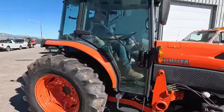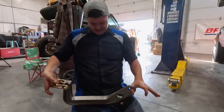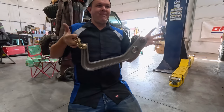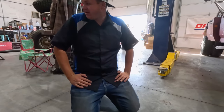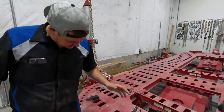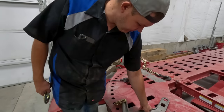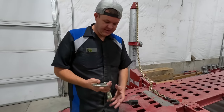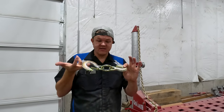We've also got a tractor to fix, so we're going to do a little bit of metal work today and show you guys the process of straightening a tractor. We can put our hook in here and our hook in here. I don't feel like this clamp is going to break - I think the chain or the bolt will fail before the clamp does. This is the MoClamp Deep Hook - it's a redesigned, re-engineered clamp that hasn't been rated yet. So we're going to do the destructive test on this clamp, and then after that a second destructive test to see where this hook fails, if it fails.